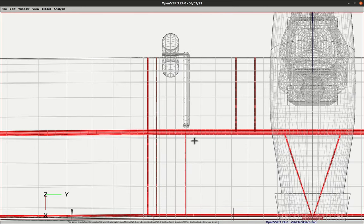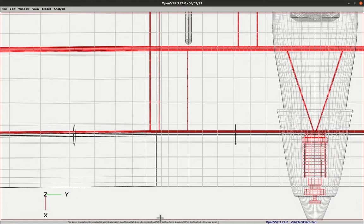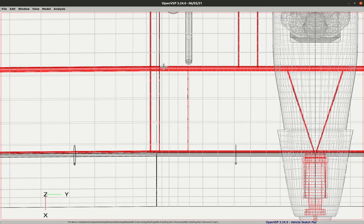Next coming out is where the landing gear attaches. Where the landing gear attaches to the main spar, I'll have a rib going rearward. When we come in and land and hit, we'll put a load on the spar that tries to bend the top of the spar back and the bottom forward. This rib is to help prevent that. There's no immediate need for a rib going forward at this location, though we might add one. Right here is where the center section and outer panel separate — it'll be a separate panel that can unbolt from the center section. I'll have a rib just inboard of that separation to help hold the airfoil shape. The tail boom will also attach right in this area, with one attach point at the main spar and two at the rear spar. Torsional pitch loads from the tail will be countered by these two ribs together.